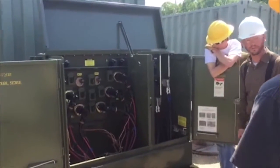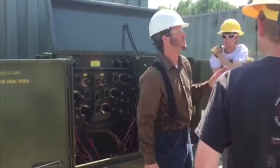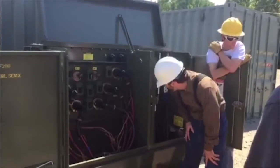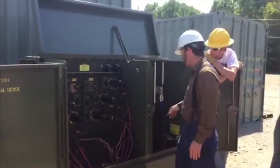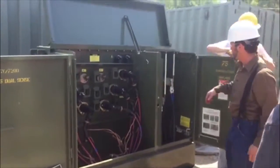Can anybody tell me what the voltage on this transformer is? It's a 75 kVA. It's a 75 kVA, but what's the secondary connections? That's right — it's 240/120, unless you change the voltage that it's set to. Come over here, you look at your tap positions, the different positions that you have, and compare that to your nameplate over here.